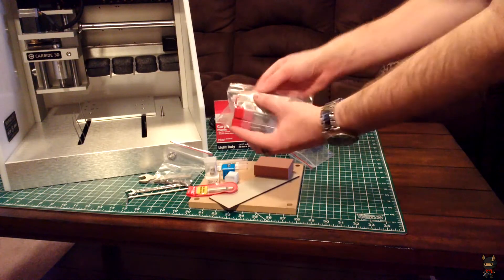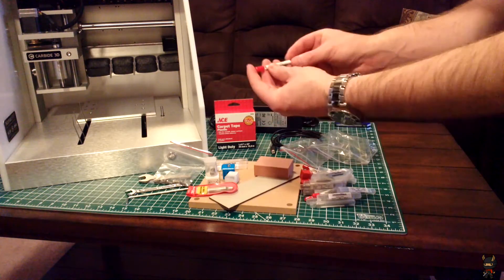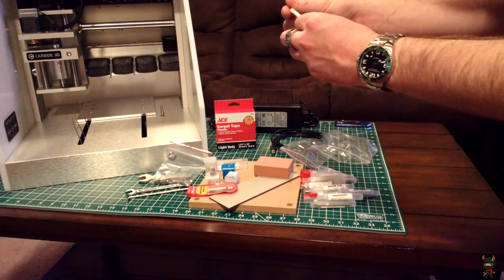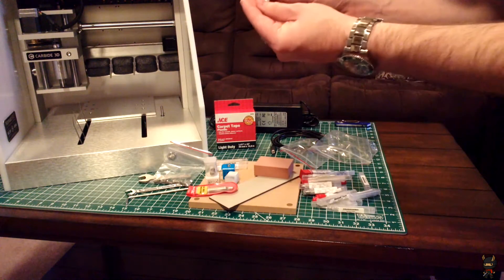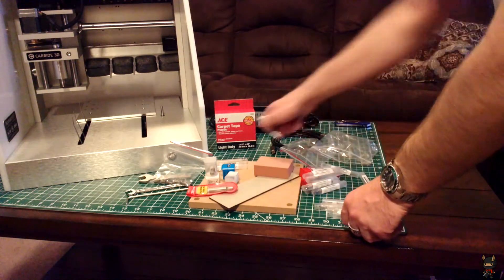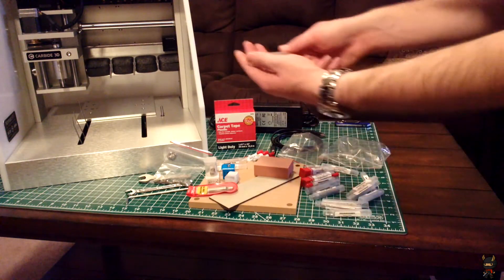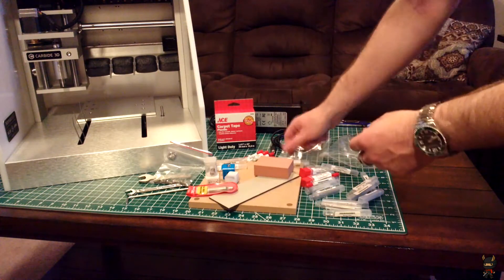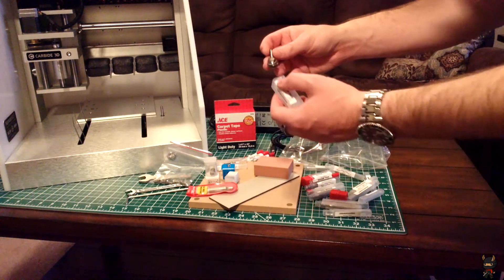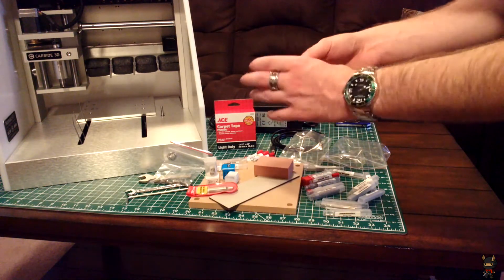These are all of the additional bits that I purchased — there's a whole bunch here. Basically I got every size they had. I have 032 ball and square, I have 063 ball and square, I have an eighth-inch ball and square, plus an additional set of those. Then I have some larger quarter-inch ones to use with the quarter-inch collet. And the last thing that's different from all those end mills is I ordered some of these little V-cutters — they come in protective wax so they don't rust. These are used with V-carve to do some really cool profiles on letters and signs.